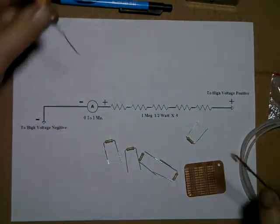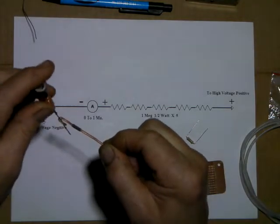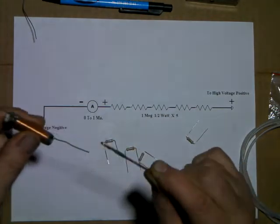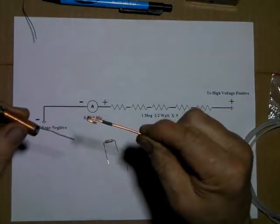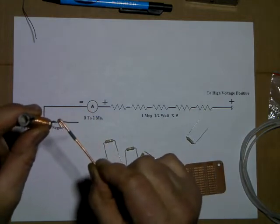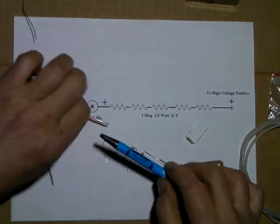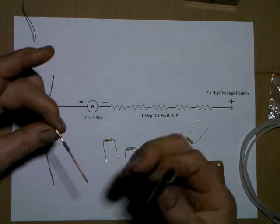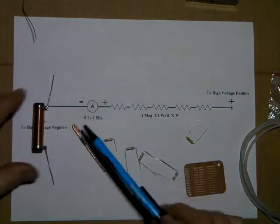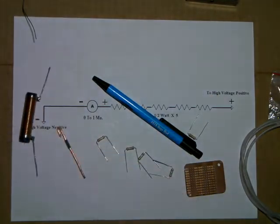What you're going to want to be able to do is to grip the base of a lead or electrolytic capacitor on your power supply. So you're going to need to have a little hook and something that'll just hang and fit. You don't need an alligator clip. You're going to want to put this on there with this mounted in your safety probe, to where you don't have to touch anywhere near it. You just simply reach in with it and grab and let it hang there while you make your measurement.